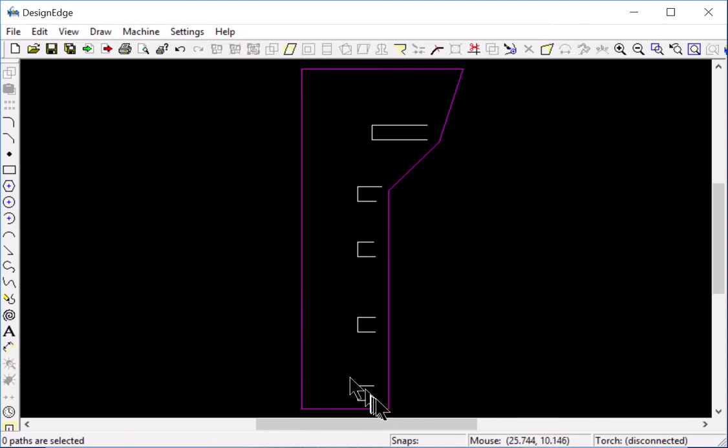Now, what's important is maybe the spacing of these slots. It might have something to do with the way the machine operates. So you can't move these slots around. They have to be exactly where they are, except the requirement is that they be 1/4 inch wide instead of 0.563. So let's draw some new slots. I'm going to say W here, and I'll say, you can make it any length, but I'll say 4, 0.25. There's a 1/4 inch wide slot that's 4 inches long.